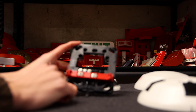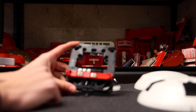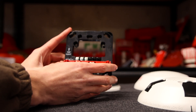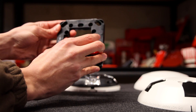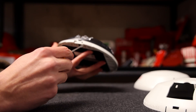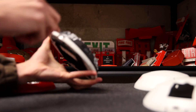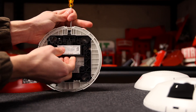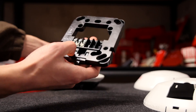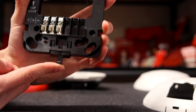Notice this little red piece — it's called a shorting clip. They say it's used for testing, but really it just binds both positive terminals together. It's not entirely that useful in my opinion. When installing this alarm, you remove it just by pulling on the sides. To remove the alarm from the bracket, instead of pulling it out with a screwdriver, you actually just push it and the mounting bracket comes loose. You just push down and it comes off — pushing this frees the alarm.